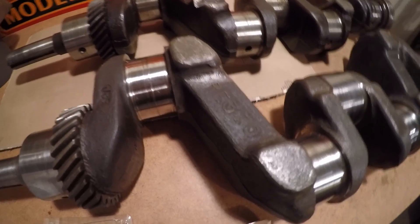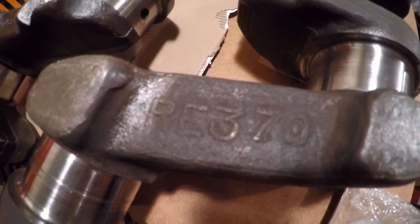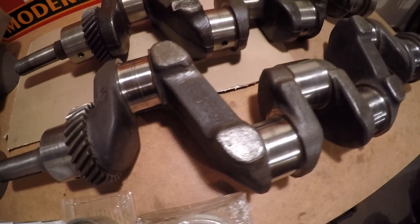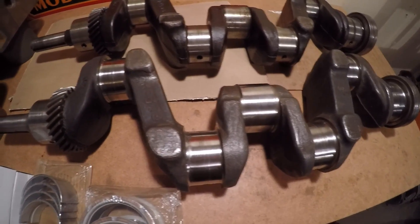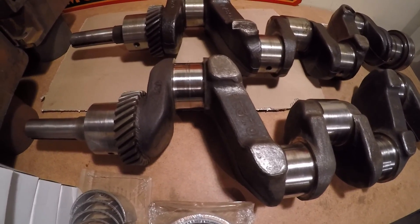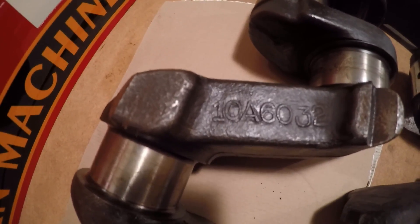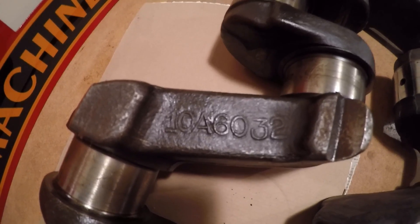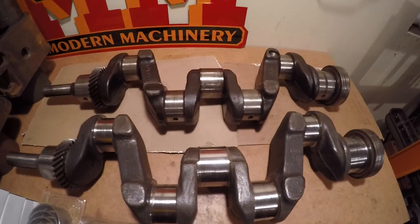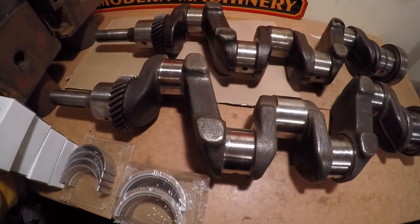The main difference is the prototype crankshaft has a casting number of RE370. My ZB parts manual shows a part number of RE5370 for the crankshaft, though I don't know what the casting numbers on the ZB cranks ended up being. The 445 production crankshaft shows a 10A6032 casting number, which is the common 10A prefix you'd find on any production 445.